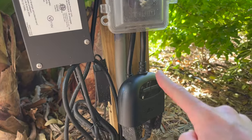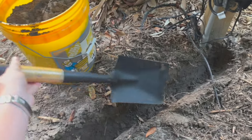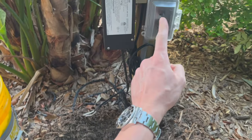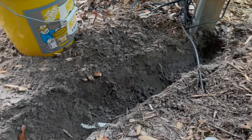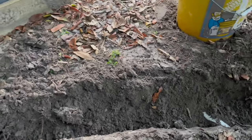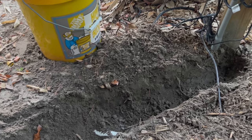I'll run the conduit buried underground and then once I have the conduit buried I'll pull the wires through. I've started to dig a small trench using a little shovel, trenching from right beneath this electrical outlet all the way over to the shed. If you're using galvanized metal conduit you only have to bury it about six inches deep, but with PVC schedule 40 PVC, by code you're supposed to be 18 inches deep.